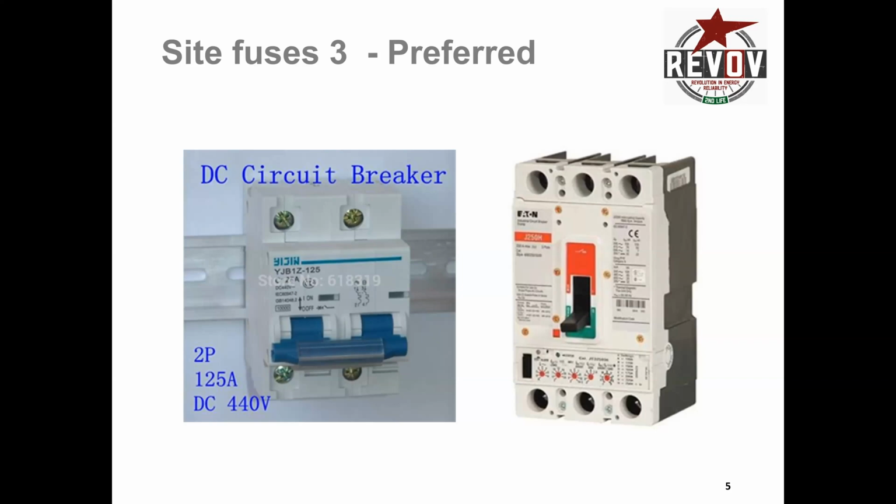The one on the right, I have seen some guys putting in these things, which is a big one, it's a 250, and it's actually for 2 or 3 battery sets. They've been putting that in, which is quite nice. The big disadvantage that I would like to stress for everyone is these bolts where the lugs come in for your DC cables. I would like you not to use that as a point bus bar.